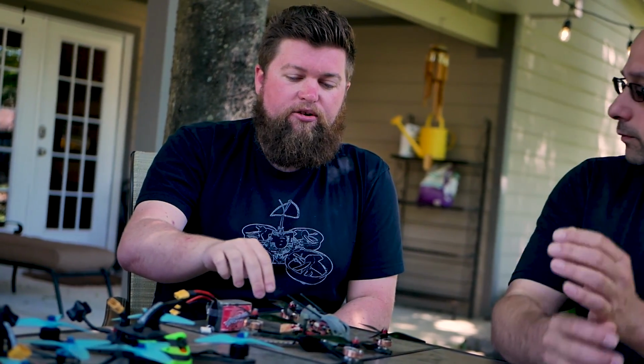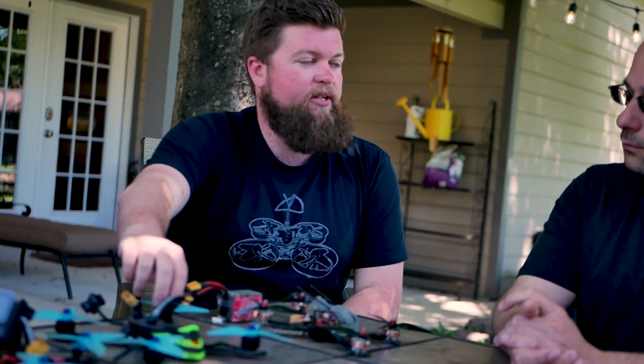There's one more point to it: as you get bigger, because when you pivot, you actually have to travel further distance, so you have to run a higher velocity. So essentially what happens is the smaller and smaller you get, the movements in the prop have to be smaller and smaller. Your RPM changes are smaller and smaller, which means your window for tuning gets tighter and tighter and tighter. And as you get a little bit bigger, you actually have to accelerate the props and give the motors a little bit more time. So you get this mechanical lag in the system, which isn't something that you're going to notice as an input lag or anything other than the system itself gains more time to respond. Therefore, overall, it can fly a little bit more stable with a little bit wider range of PIDs.